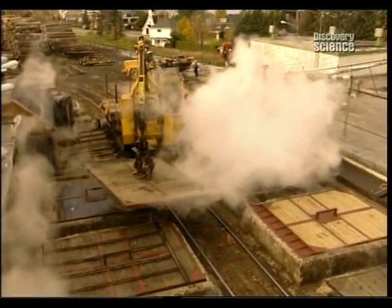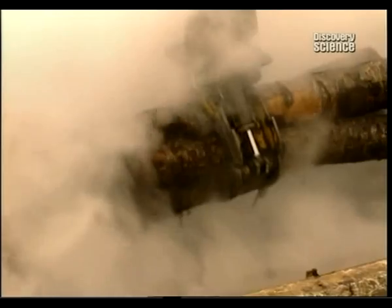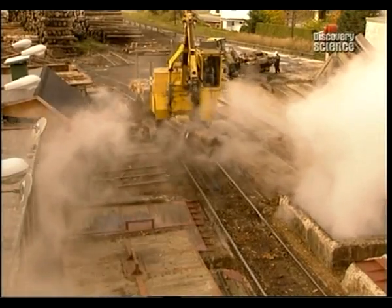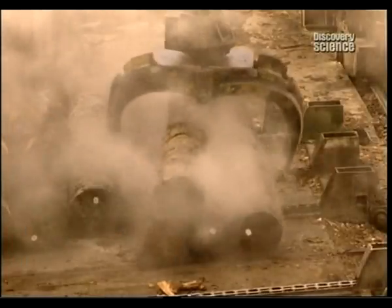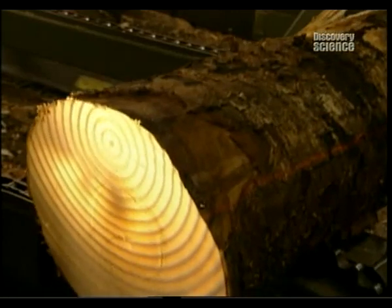The first factory on the journey to creating a door makes the plywood facing. They start by loading logs into a steaming basin. This de-ices them in the winter and softens the wood fibre. The steamed logs line up for the debarker.